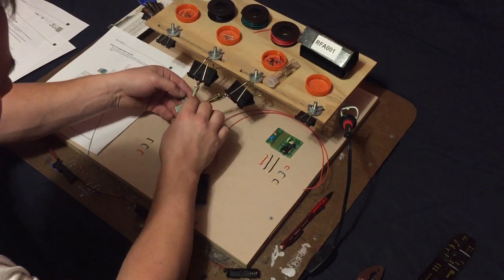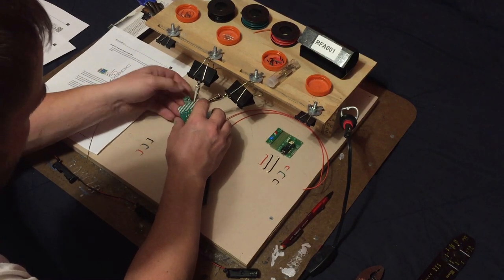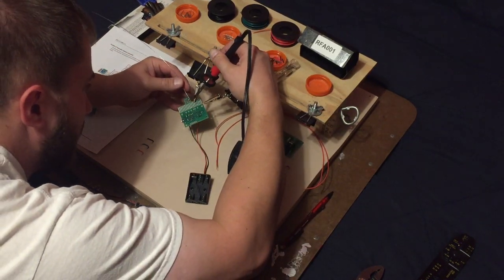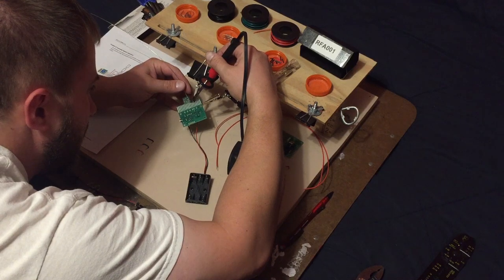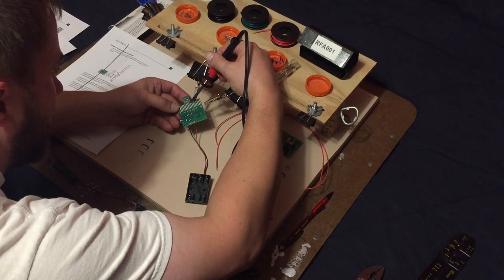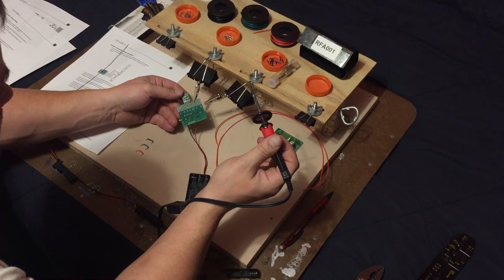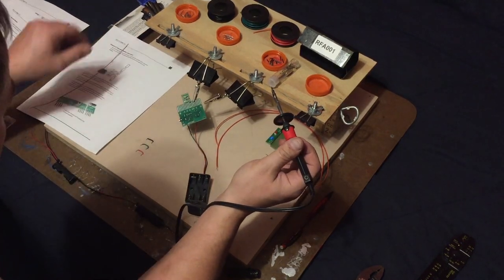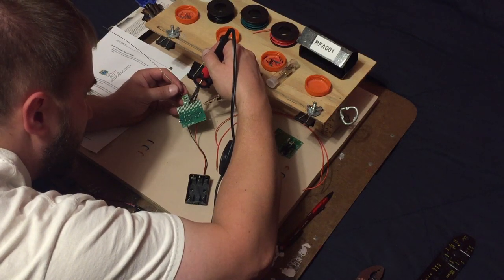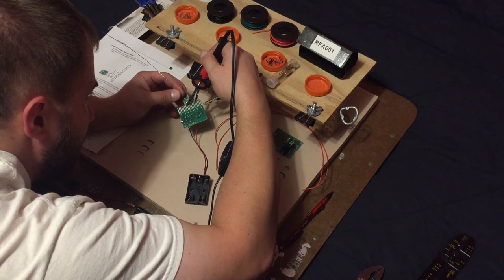Now that that's all done, let's start with the bottom pin, which is the ground. So for that, I'm gonna use black wire, and I'm going to use just underneath the 5-volt pinouts, or pin-ins, I should say. Just below that, there is a section for ground, so I'm going to use those and just run my wire from one slot to the other. I cut these to make them as straight as possible and as short as possible, and to prevent them from overlapping each other. So again, let's just clamp that into place and then solder these two pieces in.